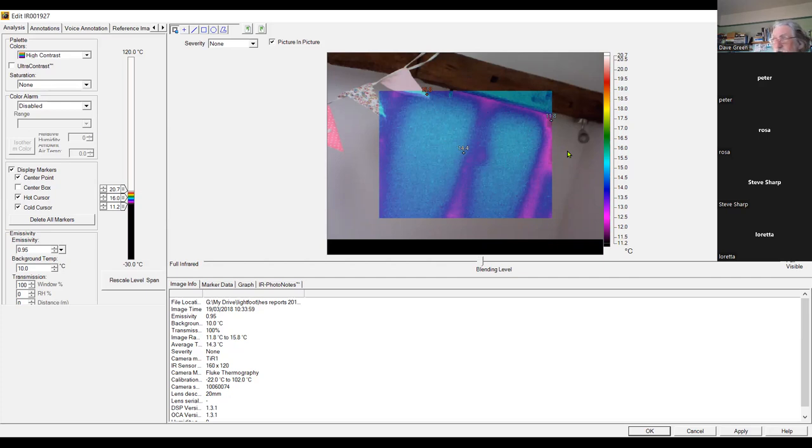Yeah. I guess I'd also comment that in terms of the impact on the heat loss from the building, it also depends on the extent of the area. If it's just a small patch compared with the heat loss through the rest of the building, then maybe it's not really significant. But like you say, it might be from a mold point of view. The heat loss through this patch will be the same; if there is no insulation in there, it's not going to lose more heat because the rest of it is insulated.